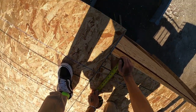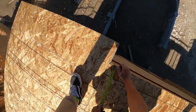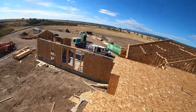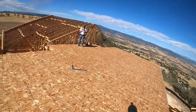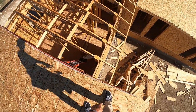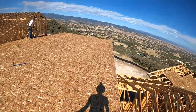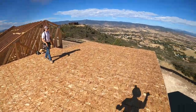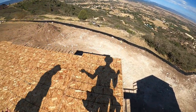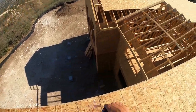So here's how we're looking — we're overhanging a little bit. Five and seven-eighths, which is about three-eighths off, so not amazing but not too horrible. Here's a really easy way to make a quarter correction in a way that will hardly make any difference: I move this an eighth inch this way, and then I'm going to move this end an eighth inch that way. That will move us a full quarter but it's still only an eighth on each side, so now on that crow's foot it's closer to the edge.